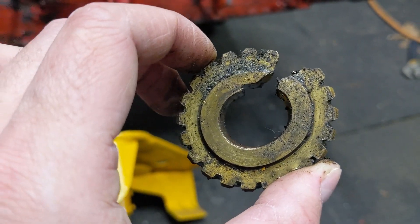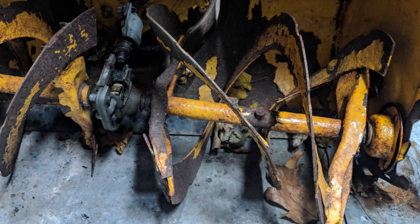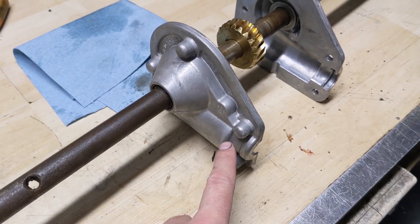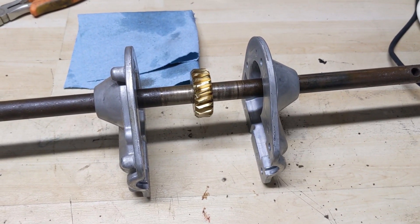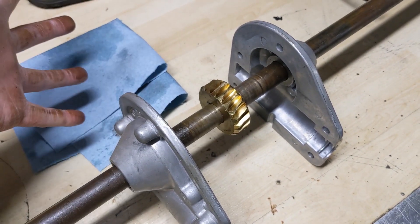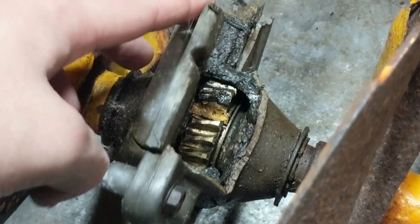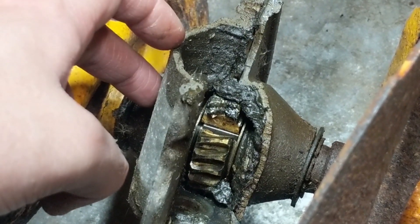You can see that's supposed to be a perfect hole right there and it's completely ovalled out — the gear has broken away. There were chunks of it inside the gearbox, and the force when you don't run proper shear bolts is quite surprising. There's a brand new worm gear and brand new gearbox side plates here — that's your entire gearbox once it bolts together. So much force was generated that not only did the gear basically explode, it shrapneled out parts, the shaft was no longer in line with the gear and wobbled around, completely destroying the bearing at the rear of the housing.